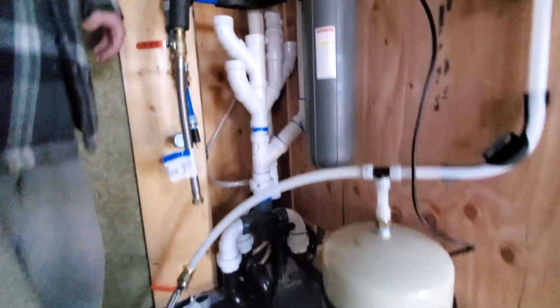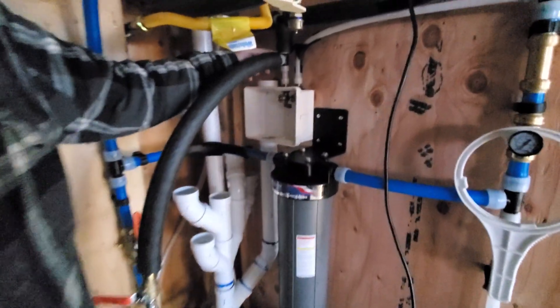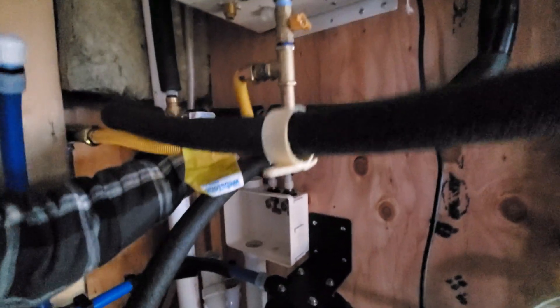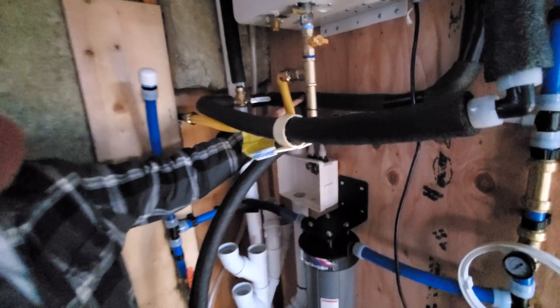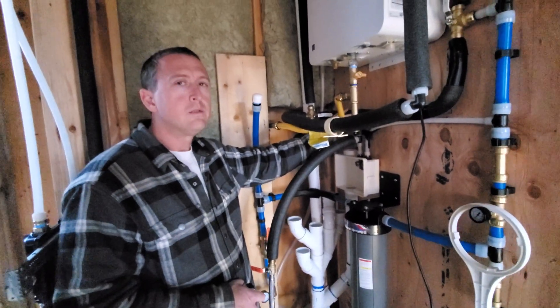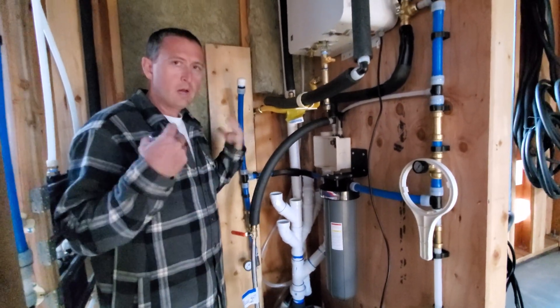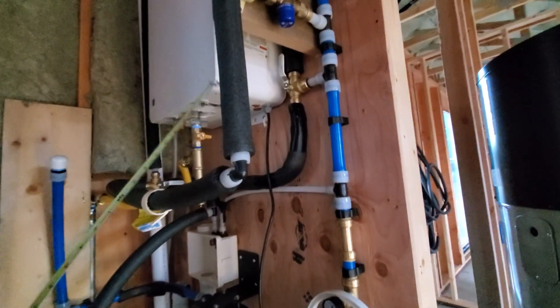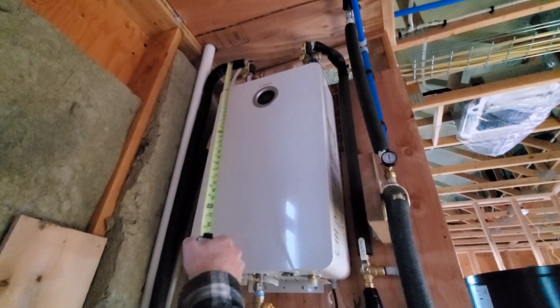The water starts cold at the bottom of the tank, and the hot water comes up toward the top and into this shutoff valve, then feeds in here. From here it tees down to the same washer setup. Otherwise it comes up here, and there are two possible directions depending on the status of our three-way valves. In the normal scenario, hot water from the tank goes straight through this valve and makes its way up to the tankless, gets warmed up if needed, then passes through and comes back down.